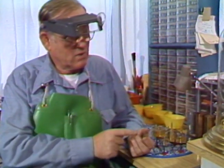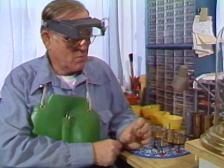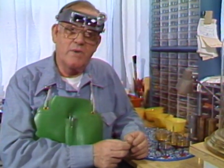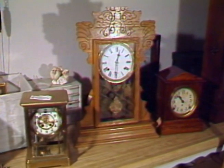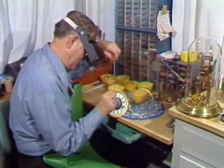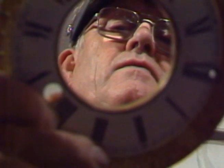This particular wheel here has one of the pins that is missing from it — I'll have to make it. You can't buy parts for the wheels of old clocks; you have to make all of them. In here, dirt is my enemy because I don't want to get dust and dirt in here. But out when the clock's being used, that's really my friend, because that's what makes clocks go haywire — getting the dirt in there that mixes in with the oil and gets like a valve grinding compound.